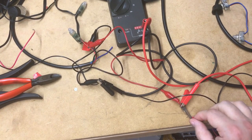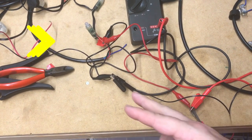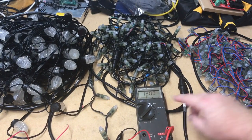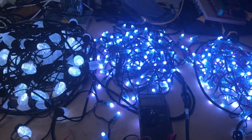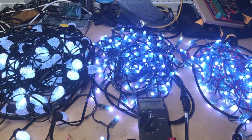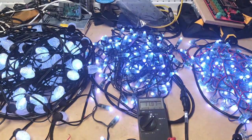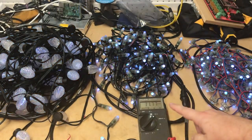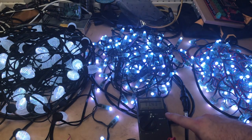I've got a second power injection now. The first one is here. This is the end of the second string, so I'm coming from the same power supply into the second string, and the voltage is already better — it's at 12 volts. Let's turn this on. That looks fantastic. This is at 100% and I don't see any issues with these lights. If you look at the voltmeter, we're staying up above 11 volts. That's not bad.